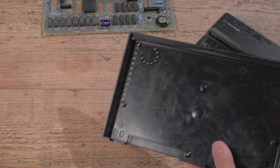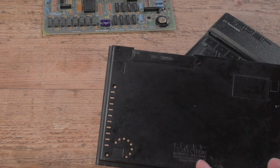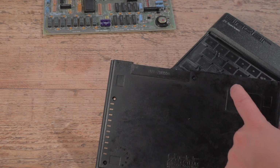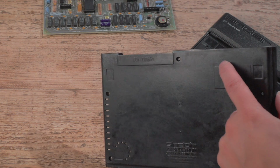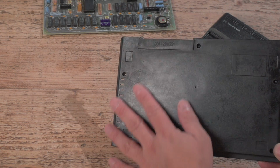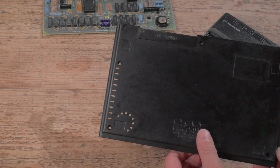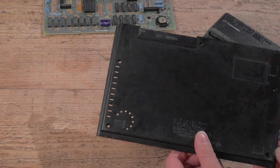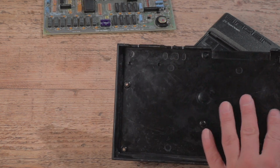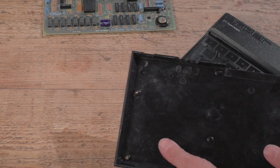Okay, right. I've spent quite a lot of time getting the glue off this Spectrum, and most of it has come off, but the problem with acetone is it spreads the glue around a bit, so you can see that I rubbed my fingernail over there. You can still see there's bits of kind of residue. In fact, the camera shows up there really well. There's still residue on there. I don't have time today to do another hour of scrubbing this, and indeed for this particular Spectrum it's probably not worth it because it's never going to be great, and there are things like scratches on the back that are never going to come off, and inside as well, again, it needs more acetone just to get the remainder of this glue off.